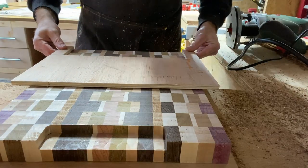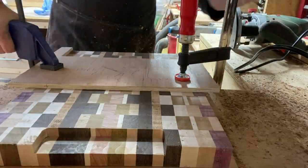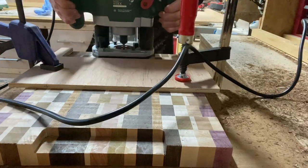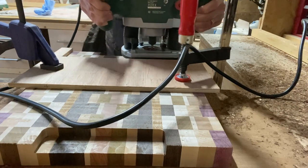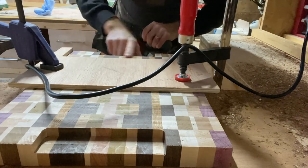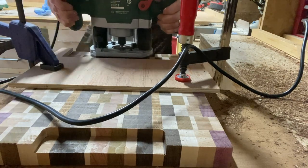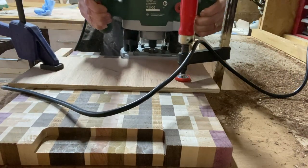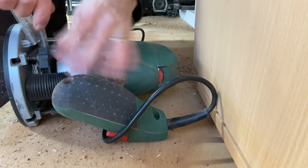It's also been mentioned that exotic wood should be wiped down with acetone, so I've managed to get some now — not that it was difficult, just bought it on Amazon. Now it's about getting the router sled back out again to smooth off the edges because after the second glue up some pieces are slightly higher than others, so I'm just skimming off the top. Then it's down to routing the handles out. This board is for me — it's going to have juice grooves for when I have chicken and things. I typically do about three or four passes to get the overall depth of the handle, which normally ends up about 50% of the thickness of the board.